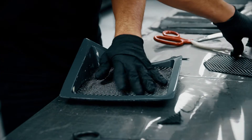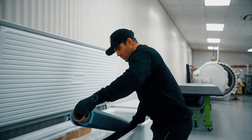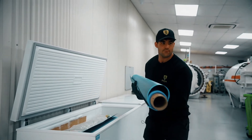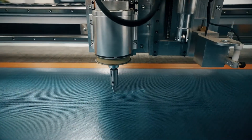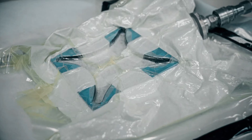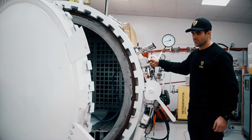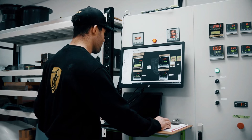What you're going to see today: dry fibres laid into a mould, put under vacuum and infused with resin. We're also going to show you a prepreg carbon fibre method, which involves cutting the prepreg carbon fibres out on the table cutter, laying the prepregs into the mould, vacuuming the mould, and putting them into the autoclave where it gets baked under high temperature and high pressure.